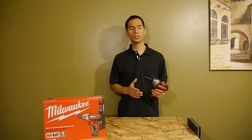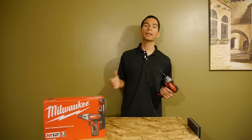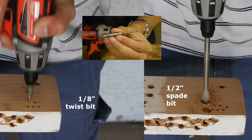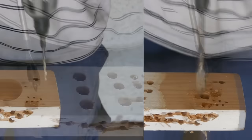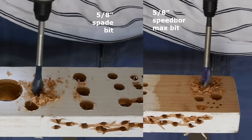The next question is how does this perform for drilling, since it shows a drill mode on the clutch? Well, it's not the best thing out there for drilling since it maxes out at 500 RPM. It can take twist bits with a quarter-inch hex shank and is okay at the task, but it's a bit slow with regular spade bits. Although it can handle Bosch spade bits and Irwin Speedbore Max bits well if you ever need to drill holes.